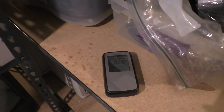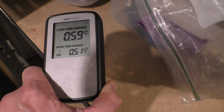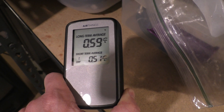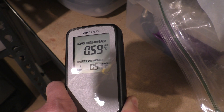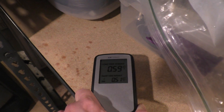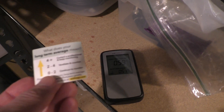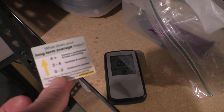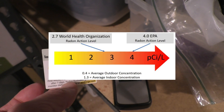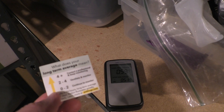It's been a little after 24 hours and we do have a reading. As you can see, we have a short-term reading — the bottom number — of 0.51, which is actually pretty good, a lot lower than I expected for this area. I'm already starting to get a long-term reading of 0.59, which is slightly higher, but it's really only been slightly over 24 hours. The cheat sheet says anything under 2 is pretty good, but again it's just the short-term reading. You really need 48 or more hours for the longer-term reading to have confidence in the numbers.